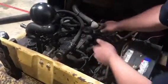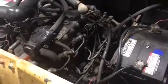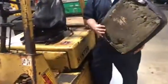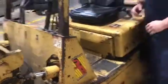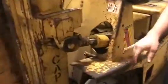While you're doing an oil change, you might as well do a fuel filter. And while you're doing a fuel filter, just do an overlook, make sure there's no leaks or anything like that. Alright, so let's move on. The seat comes off, that's not good. The seat needs to be bolted down properly. If you come over here, you check the hydraulics, make sure everything's good, make sure that the cylinder's good,